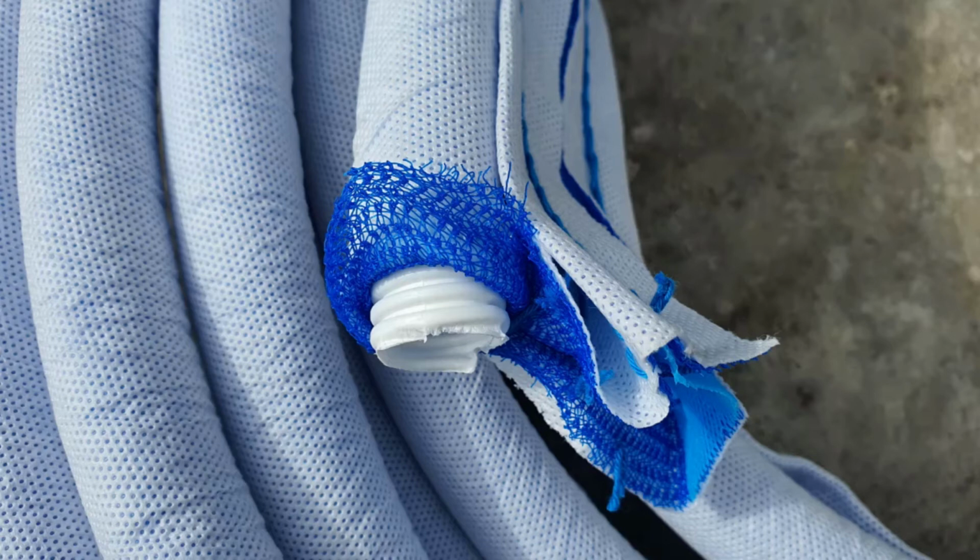This hose is called Blade Runner. It sounds something really exciting, but actually it's just a resin infusion hose. Normally you would use a normal hose that goes through into the spiral wrap, which I mentioned earlier on with the MTI hose. This is the one that I use though, slightly different. It's quite a large bore hose. It's actually 15mm. It's a corrugated hose, as you can see, and it's then surrounded in this cloth. The cloth has a flat flange at the bottom, the idea being that once the vacuum is applied, this flange then distributes the weight of the hose and it stops leaving any marks.